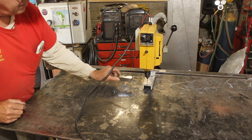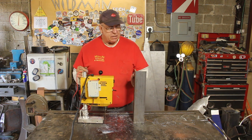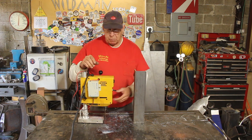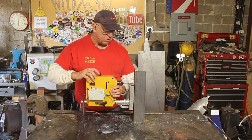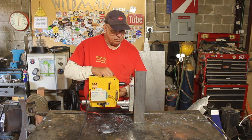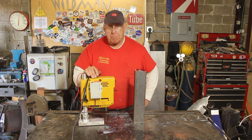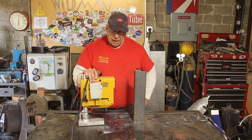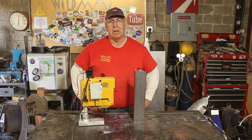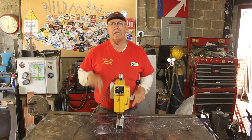Well that is all I need this thing to do and it works. Let's try it in the real-world application - this here is quarter-inch thick angle iron. I'm going to have to drill dozens of 13/64 holes in it so I can tap quarter-20 threads into it, and it's going to have to be a horizontal drill like this. Well that worked pretty good - I call that a success. I'm into this thing about 55 bucks for the electromagnet and the power supply, and I think I gave 20 bucks for this drill at a yard sale. That's not bad for a mag-based drill press that will do the job. I'll leave links to the power supply and the electromagnet in the description below.